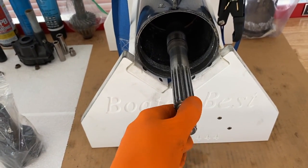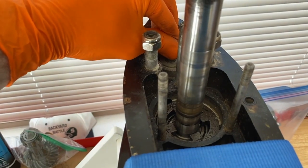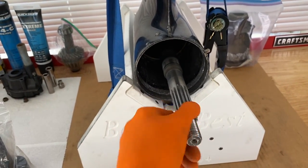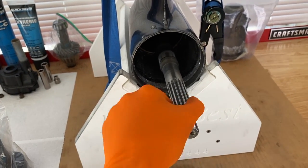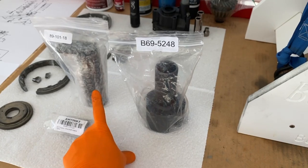In our case right now it is in gear, so we are going to come up top and shift it counterclockwise away from the gear. Coming down below, the propeller shaft is in neutral — not in reverse nor forward. Next we need to open some parts; we're going to open the adapter nut and retainer wrench.